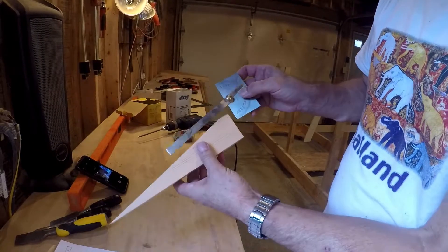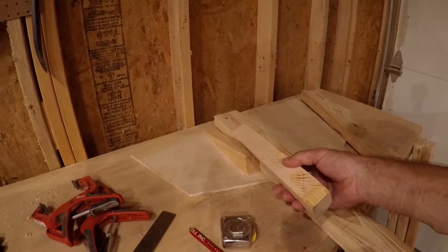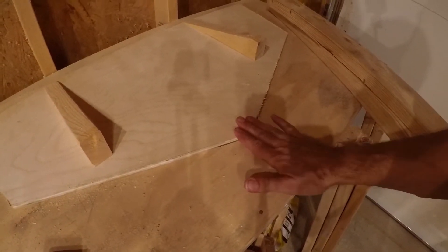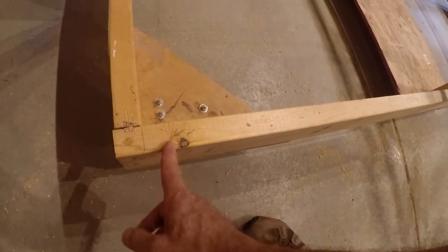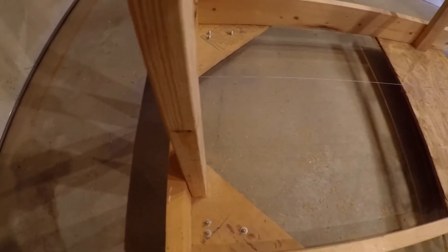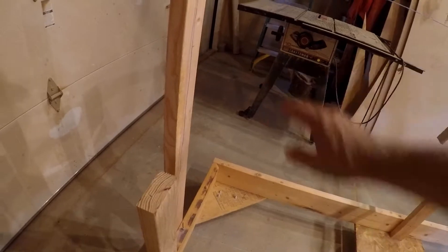Where do they replicate it? Right there. These two wedges — we're going to arrange them on the outside of the transom so that the top or bottom, depending on how you're looking at it, will be on that same angle. We want this point to be held at our 14-foot line for the boat, which is an inch and a half from the end of the strong back. So we're going to put vertical 2x4s, which will take us exactly to that inch and a half point, and fasten the transom with those wedges at the right height. The keel center, the tip of the transom, is at the right height below the reference line — that's the plan.